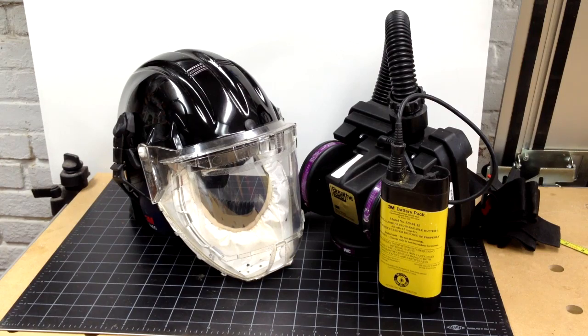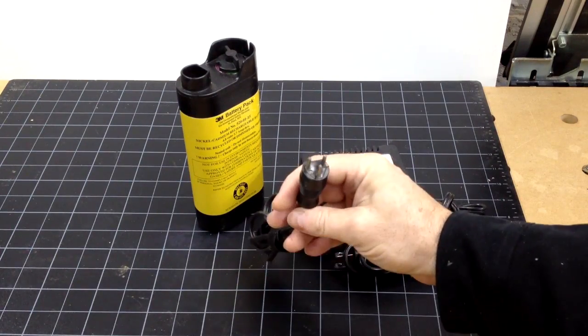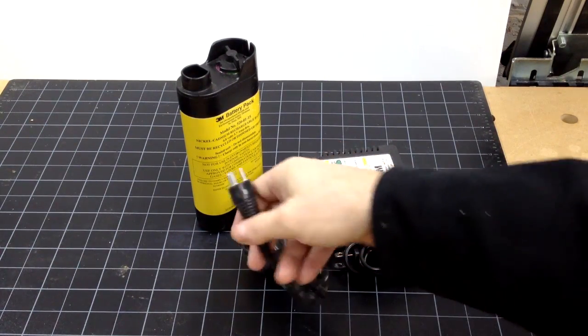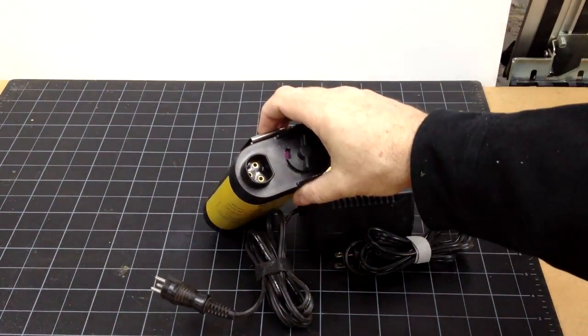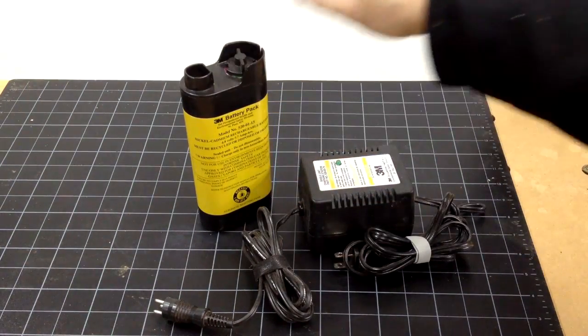When I came across a buy on the Airstream helmet — a one-piece unit — it came without a battery, so I was looking for a battery for it. This is the NiCad battery pack for the Airstream or the BreatheEasy. It's 4.8 volts, 5.7 amp hours, and has a three-prong connector. It turns out only two prongs are live: one is ground, and the other two hot ones are actually wired together.